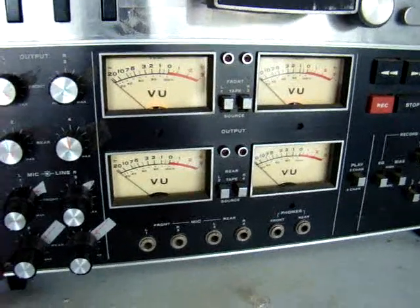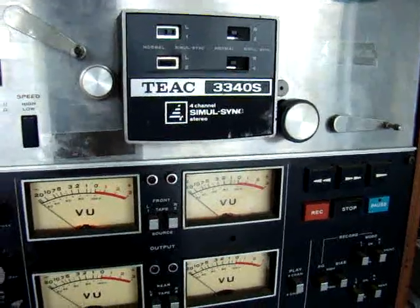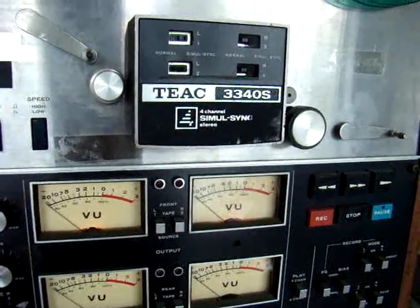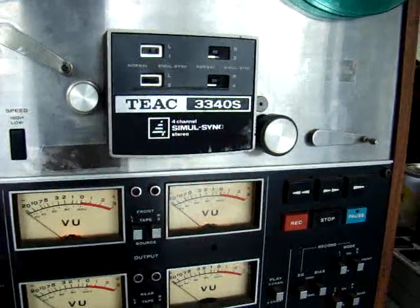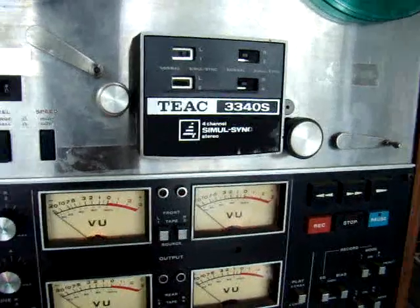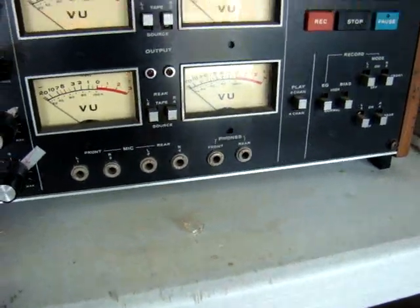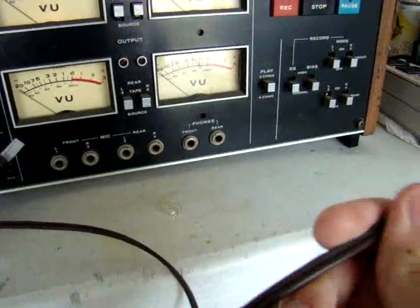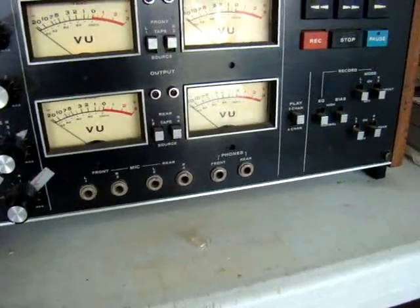Oh, the other thing is, I'm now selling the wire by the foot. I've got 18-2 lamp cord, 18-3 black round service cord, and I'll be getting 16-2 white and possibly brown as well. Probably I'll stick with white for a while, as you know, number 18 cord's 10 amps versus 16, which is 13 amps. So there's not much of a difference. 3 amps isn't a whole heck of a deal for anybody. So I'll mainly stick with carrying this and just get some white 16-2, just to have some 16-2, but to have some white as well.